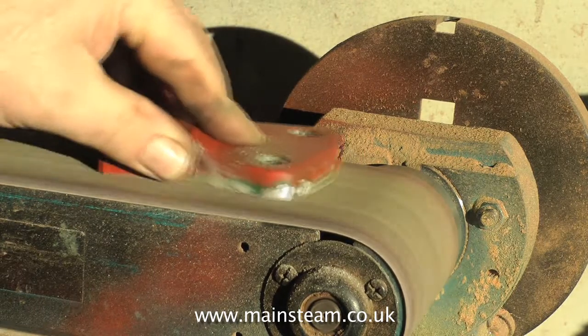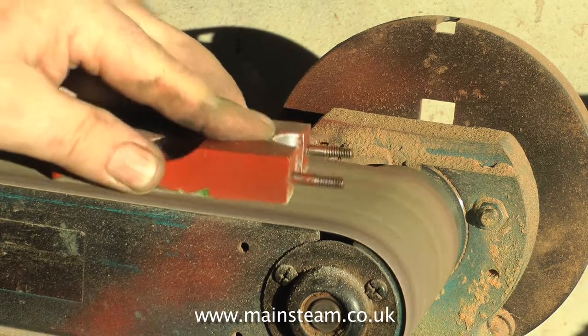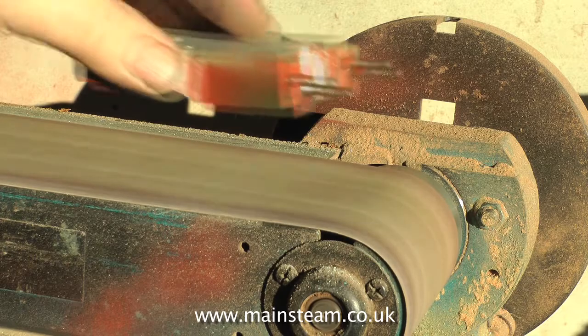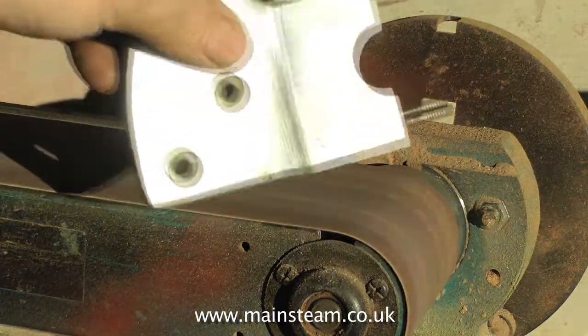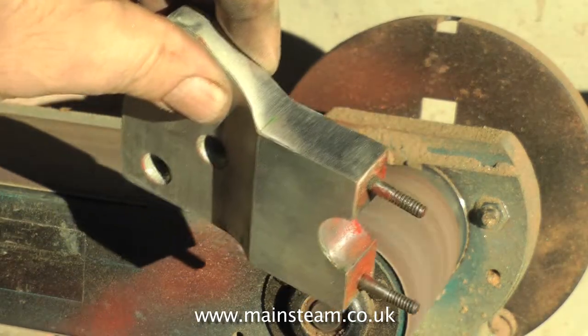No need to put these in the thinners. I want to do two things here: one is remove the paint and reprofile the parts. They're quite well machined, but the shape's a little bit off, so whilst I'm removing the paint, I'm going to reprofile the part. It's worth mentioning that when you're painting metal parts that have no paint on them, you need to use a suitable etch primer first — this will bite into the metal and give a good key for the paint.